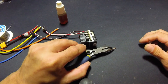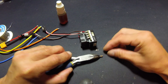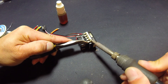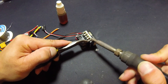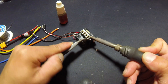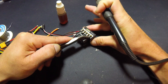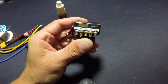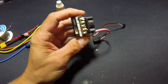So that's a beautiful example of how not to do that. Let me show you what to do if that happens to you — how to fix it right here. It's still very hot. Hold it in the pocket, line it up with the hole, apply a little bit of heat to the back side to get the solder to flow, and that should go right back in. Let it cool off. I did melt the plastic just a little bit there, but the solder flowed back where it's supposed to.